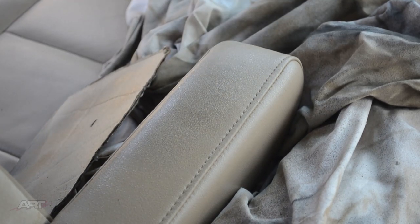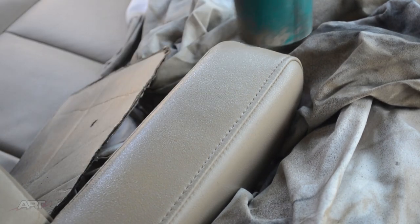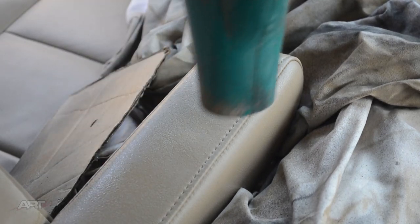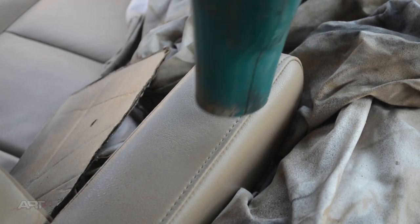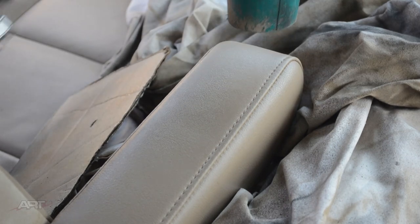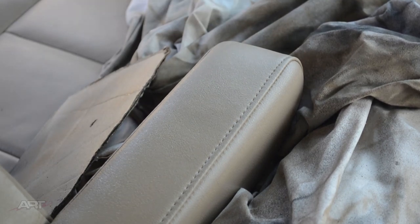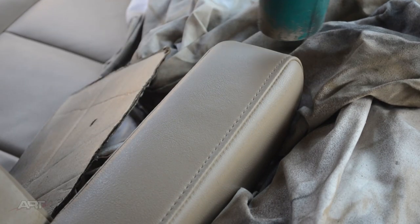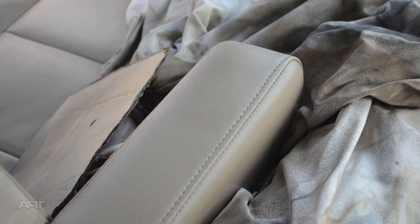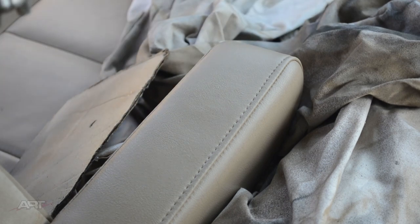I'm following up with the hair dryer so that these droplets will dry more quickly. In the injection mold repair business, when they repair a grain mold, there's an area between the repair and the original mold — that's a telltale sign you've been there, and they call that area the witness. So how do you avoid that being obvious? This is the way: we put a light spray grain with our color from the original vinyl through the repair and totally blend in the witness area.